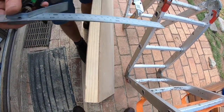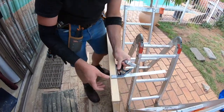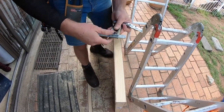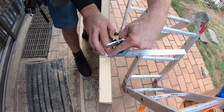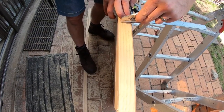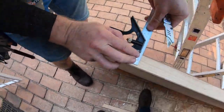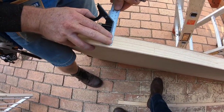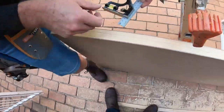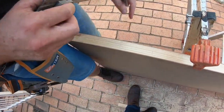It's important to remember which side is your front and which side is your back, because you can easily make a mistake. I'm going to use a blade to mark out where things need to be done. We're going to make the recess this deep, and there's our little mark for the hinge. Same situation for the second hinge — mark it up to there. We've made our marks on the side, so we're going to score it with our blade, then mark it out in terms of depth — scoring it with the blade again, running it parallel. Now we know how deep and how wide we need to make the recess.